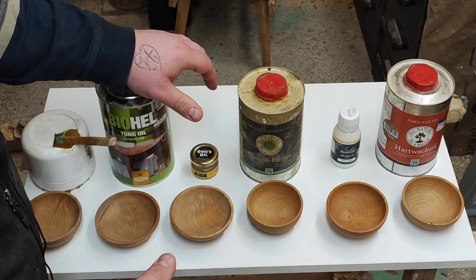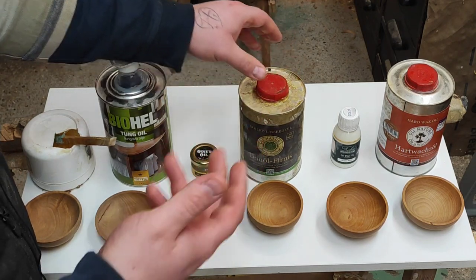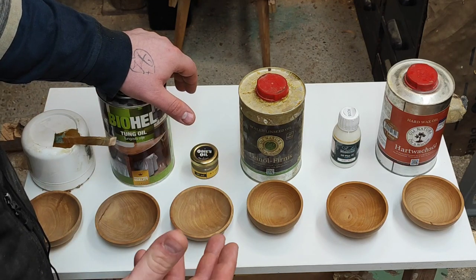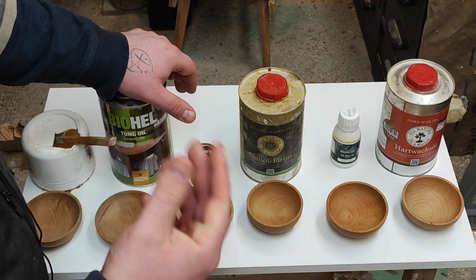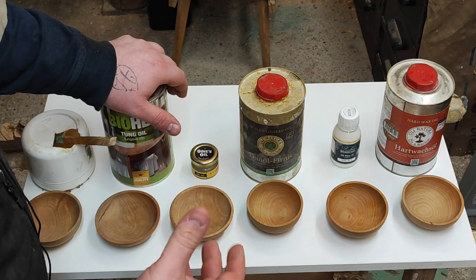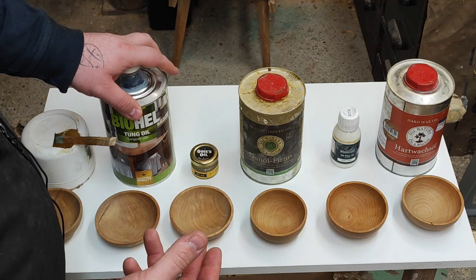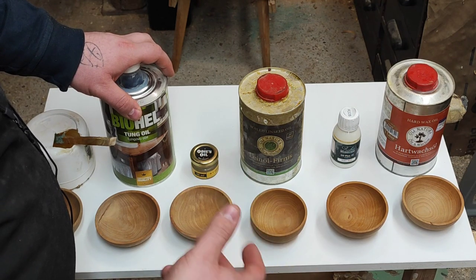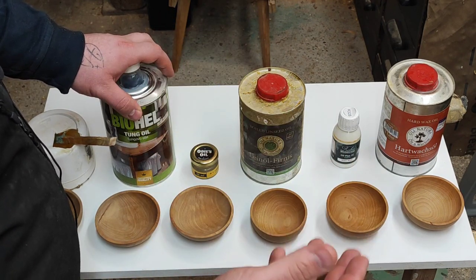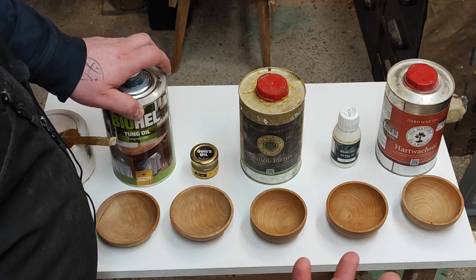So stuff like natural oils, like walnut oil from Mahoney's, or this from Oli Natura, or from Chestnut Products, they have similar oils. They don't seal the wood. The wood still breathes quite nicely, and it can still absorb moisture and release it, and it acts naturally. And hard wax oils are also quite good, but for most brands, the price is too much for me, at least, to justify putting on bowls, when customers will probably never buy that same oil and refinish it.